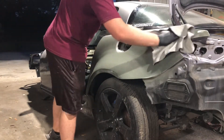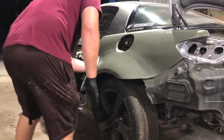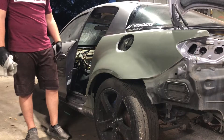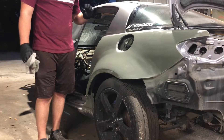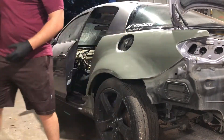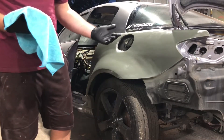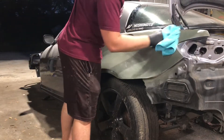I should probably be removing this rear window just to make sure I can get real tight up in there, but I just don't have time for that. Also, over here is where the rear door mounts — I'm going to be doing carbon fiber up until that area, but I'm not going to be cutting the majority of that area out. I still want the door to be structurally sound. I'll note this just so I don't get sued: if you're doing this, your body is no longer stock strength. If you were to get in an accident with a full carbon fiber door and you don't have a roll cage, it's probably going to shatter. I plan to be putting a cage in the car, so I wouldn't do this if you weren't planning to do all that.